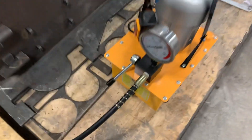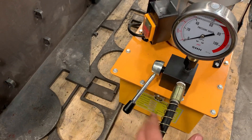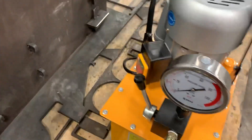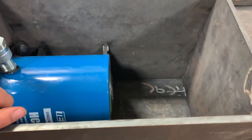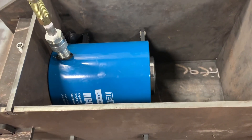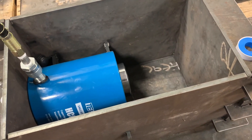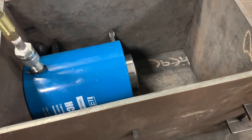We just filled this up with hydraulic fluid. There's an on/off switch, and this lever down is not putting pressure to the hose. Once you go up with it where it's tightened, it'll put pressure into the hose, which will fill up that cylinder. That cylinder only has about four inches of a four-inch extension, but that's more than what we're needing. It's on now — it's sending hydraulic fluid to the cylinder. It's really slow, but for a hundred tons, this is kind of the best setup we came up with that was semi-portable and would give us the pressure we needed. You can turn that off, release that pressure, and that cylinder will start to go back into the housing.